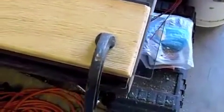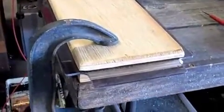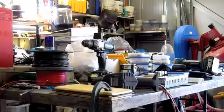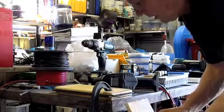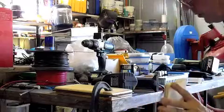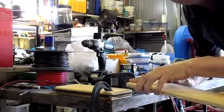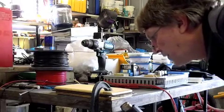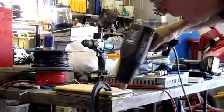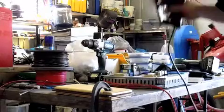Okay, my former has been placed on top of my perspex and another piece of wood placed underneath just to support the plastic when I heat it and fold it up. And what I'm going to do is heat it up gently on both sides, use the piece of wood to gently curl it up and over, and then once she's over, I'm going to hold it there with this piece of wood until it cools down enough to set in that position. And the outside usually needs a bit more heat because it has further stretch than the inside. Let's give that a go.